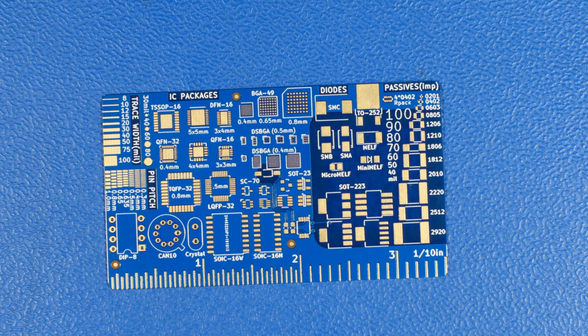It's powered by a tiny NXP NFC chip, with power harvesting capabilities. The small TSSOP 8 package is still big enough to hand solder, which is a major plus. This chip handles all the NFC handshakes and can harvest enough power from a phone to power the chip, transmit a web address, and blink an LED. Crazy. You may have noticed a change in style with this card.